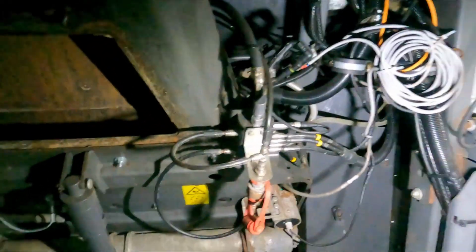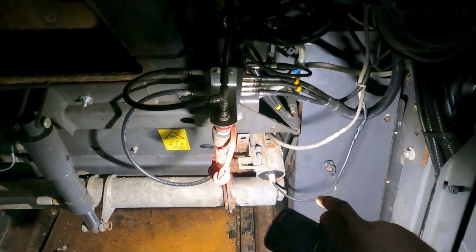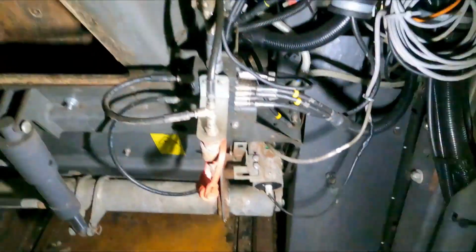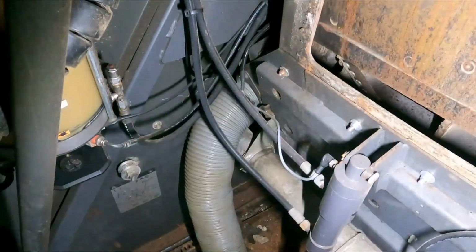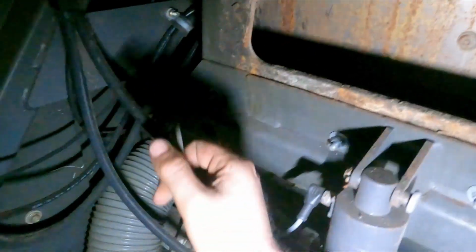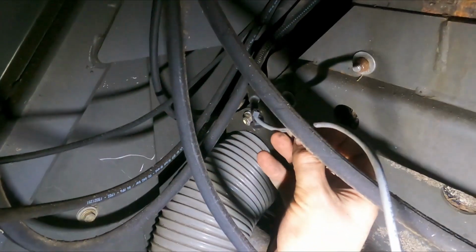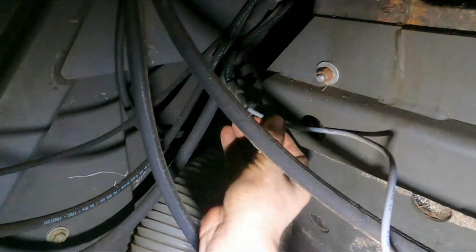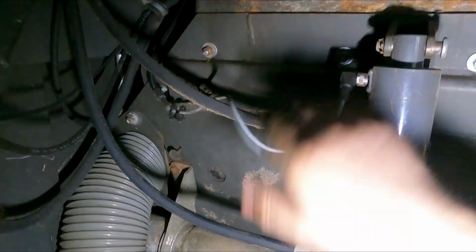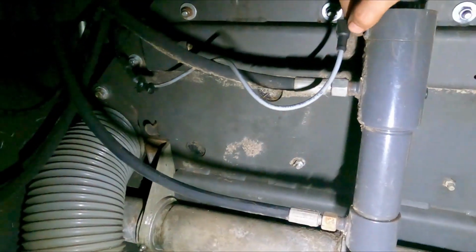If you've got the silage additive system from Schaumann, you will have the injector here. That's this thing. So you've got additive pipes, you've got cables going to that. The adjustment for the accelerator, check the cable. Often not, you can see here this cable's not secured as it was supposed to be. Usually you'll have one quick attacher and it's broken off. Usually you'll have one here and another one somewhere else. But people like to let things fall on these, notably the vacuum tube, and they can break off here.